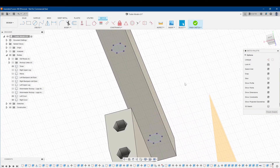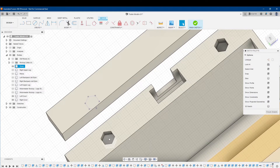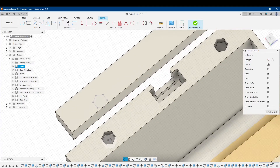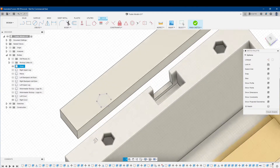The reason I made hexagonal holes instead of circular holes is that hexagonal holes with open corners around a circular peg prevent the hole from developing a vacuum on the peg. If there's a vacuum, it's going to be harder to pull out. The hexagonal holes prevent that by having openings around the peg. This is basically a circumscribed shape — the circle touches the flat sides of the polygon. An inscribed shape has the corners of the polygon touching the inside of a circle. These are circumscribed.